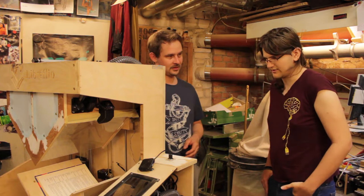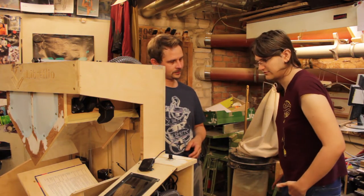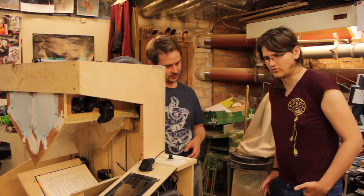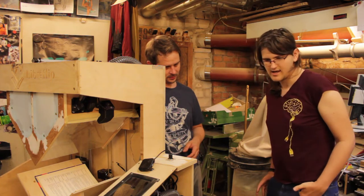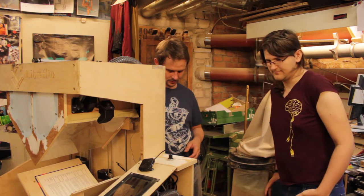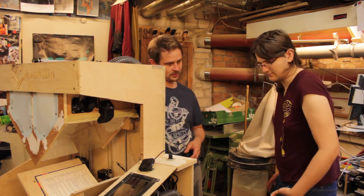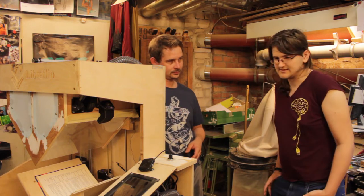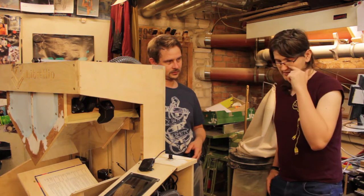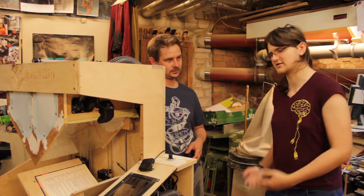From a design perspective, a PCB would be a lot easier. There'd be a lot fewer wires involved, making it one drop-in component solution for all the control electronics. That would make it more reliable, more durable, and easier for the person assembling the machine, because there'd be less cables and fewer places for mistakes. PCBs can still be done in open source, though the added difficulty is that someone wishing to reproduce the machine has to manufacture the PCB themselves.